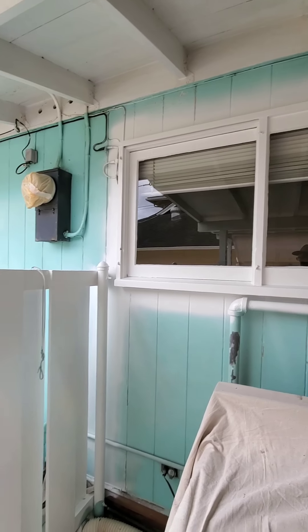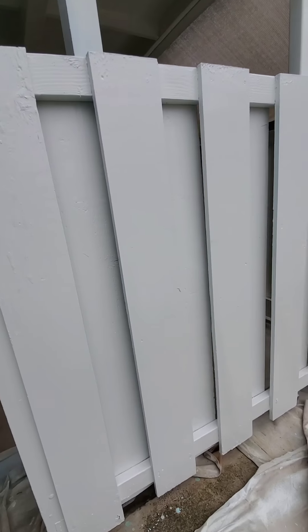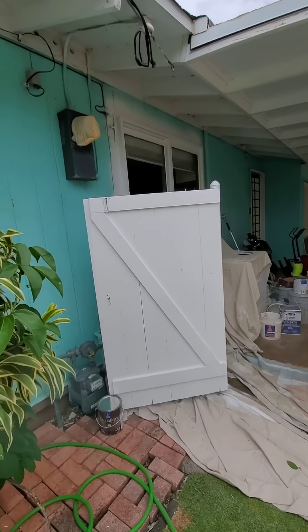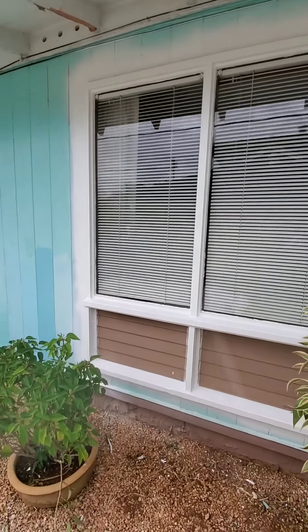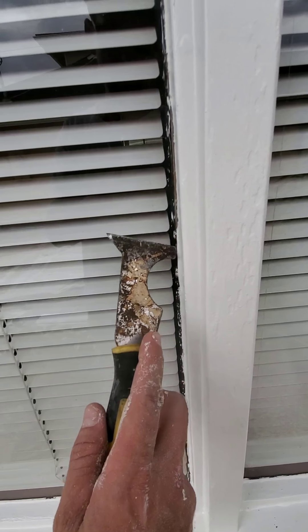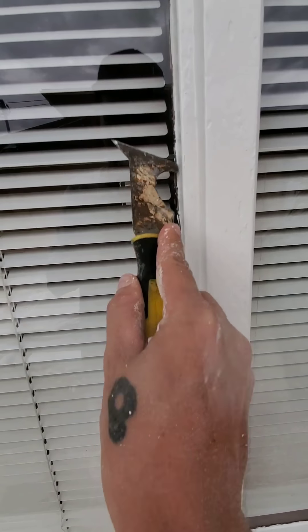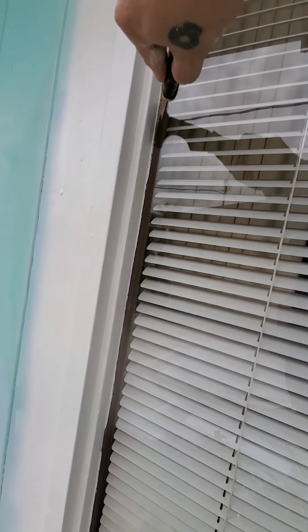I did this fence on this side — it was also green. So we did both sides. Got a couple little touch-ups here and there. We're going to go through and do all the windows first. We did that today — two-coated, used the liquid masking. And you can see where the previous painter's paint was on the window. When you use liquid masking, it kind of sticks to that a little bit. So it's better to go around with a five-in-one afterwards and clean the old painter's paint off — that way it doesn't look like you did it.